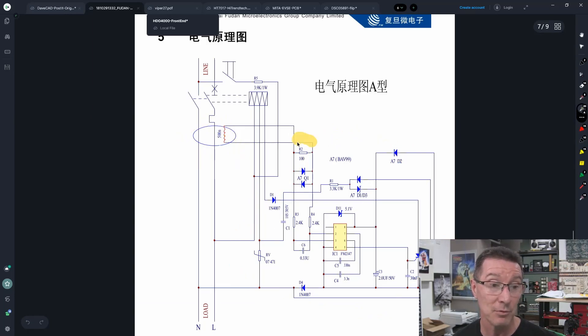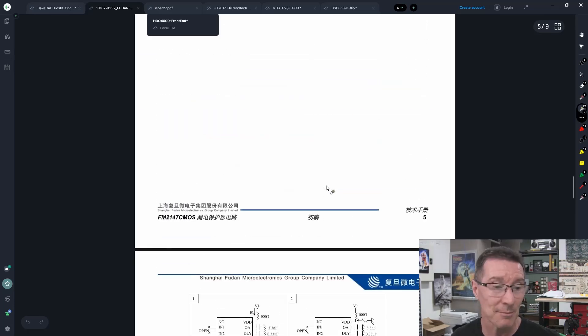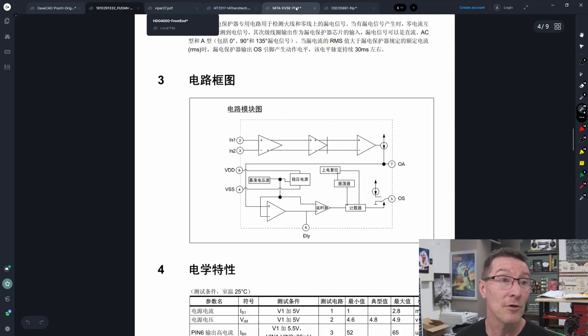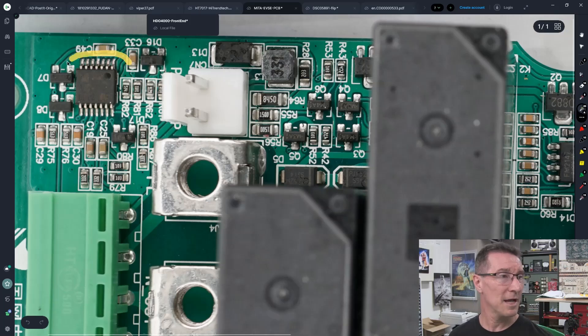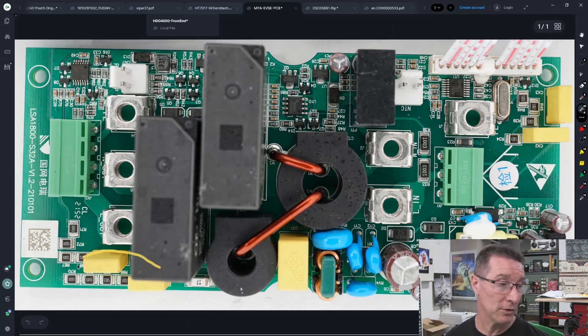It's got a block diagram and an application schematic — I bet this is going to be pretty darn close to the application circuit. It's got a specific input there for the current transformer, just measures the imbalance. I don't know what it's set to — maybe it's fixed to some standard 30 milliamps or 50 milliamps. That's a dedicated earth leakage breaker chip, as you'd expect. And this up here I thought would have been a micro to drive this pin, but it looks like it's an ST 2902 — just a Joe Bloggs quad op amp. That makes sense because you've got two capacitor droppers down here and a high-voltage series resistor, so that trace is going off to do some sort of monitoring for the car side. The micro must be over on the main board.